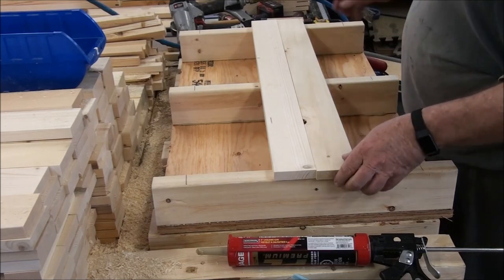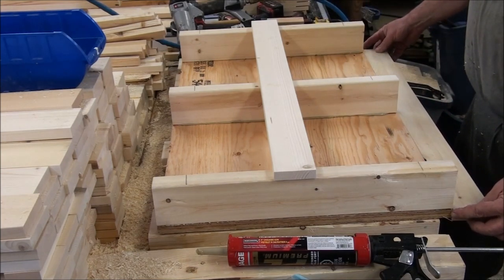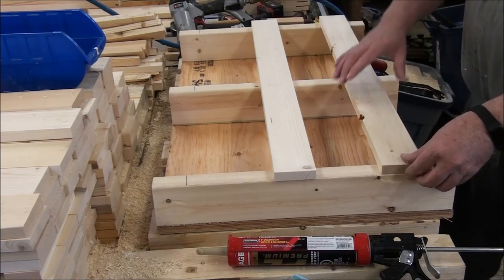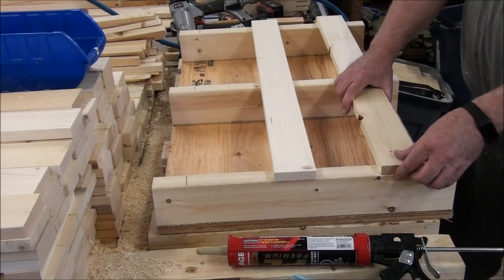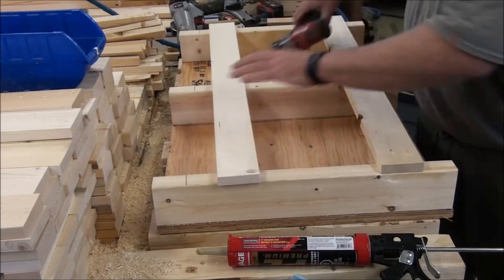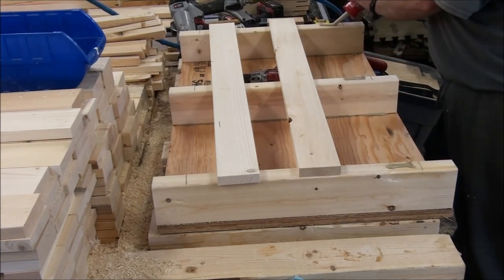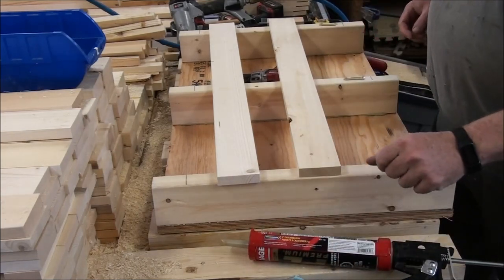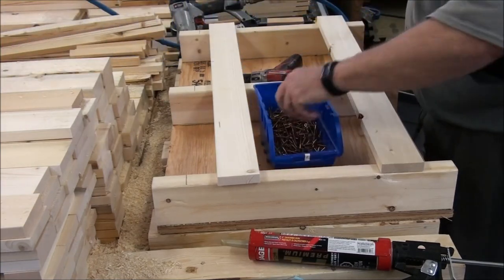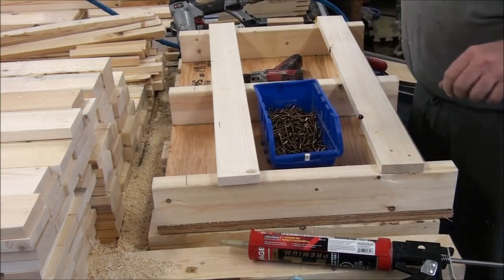Let's make sure there's no sawdust under there. Now what I've been doing — I know that this plywood and this runner are exactly the same width. The runner is the same length as the plywood is wide. What I'm going to do is flush that to this side, just back from my line so I can see the line, and approximately in the right area. Drill one hole — that will locate my screw — and then go ahead and apply my glue. A little bit of glue, and I can feel it has located that piece exactly where I want it.